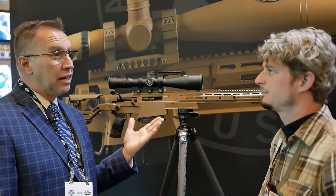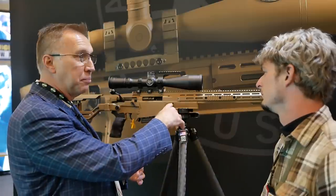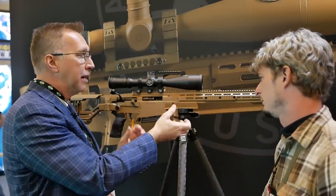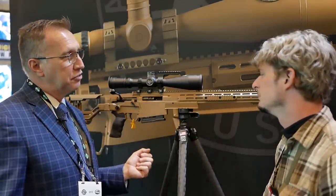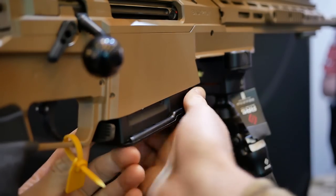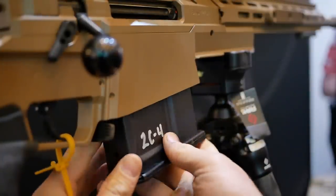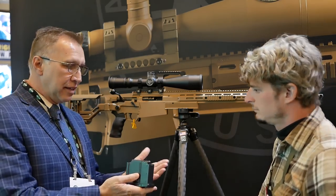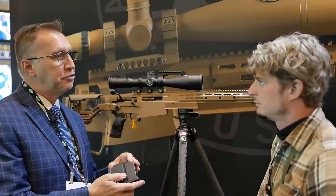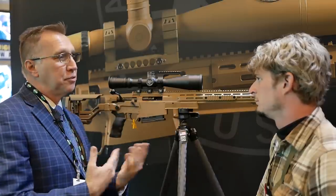This gun, like the MC, is a multi-caliber rifle. The user can change a barrel in about a minute just using a simple 4-millimeter hex tool — untork the clamp, spin it out by hand, install a new barrel in a different cartridge. Right now this gun is configured as a 7.62, and we have a 7.62 magazine. The previous design required a magazine adapter that went into the large aperture to run the small magazine from the AX308. This time, feedback from the end user guided us to make a magazine for the 7.62 that was native to the aperture without using an adapter.